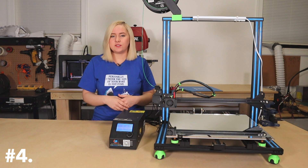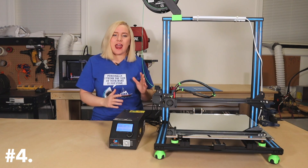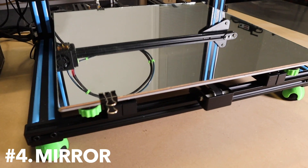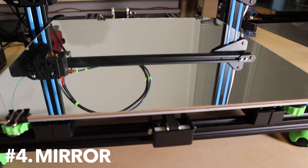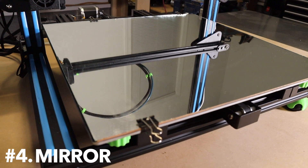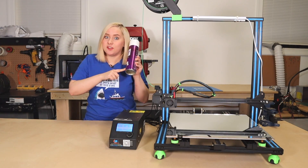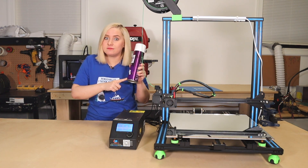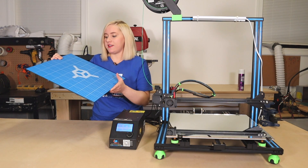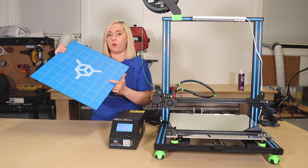Upgrade number four. So your printer comes with a glass bed, which is fine when you're starting out. However, you want to go ahead and swap that out for a mirror. This right here is a 16 by 16 mirror — I got Lowe's to cut it. They had some spare, so they gave me the thing for five bucks. The great thing about mirrors is that they're normally flat, unlike the glass bed that your printer comes with. And for bed adhesion, Aquanet — this stuff is awesome, use it. Another great option is to get the EZMAT by TH3D Studio. I haven't had a chance to print on it yet, but I've heard really great things and I cannot wait to try it.